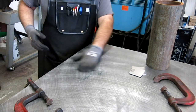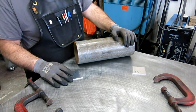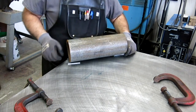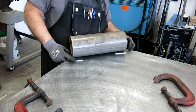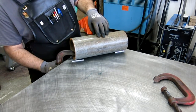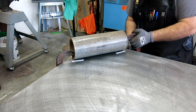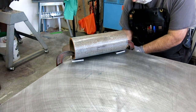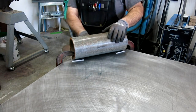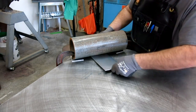So we're going to form our strip over here using the same tube, but we're going to use the table as part of our forming setup. I'm going to put some shims under here - these are just slightly thicker than the material thickness - and put it on the corner of the table. I can get the clamps in here really easily. We're going to clamp that down nice and hard, and the same thing over here, clamping it right on the shim, nice and tight.